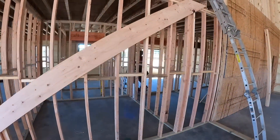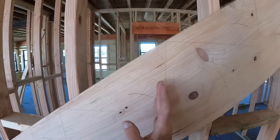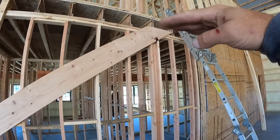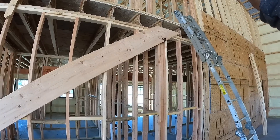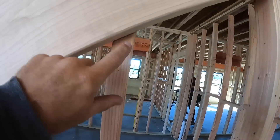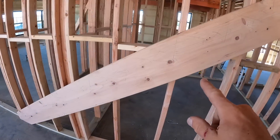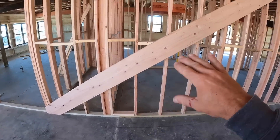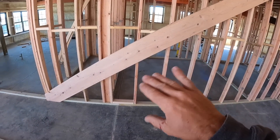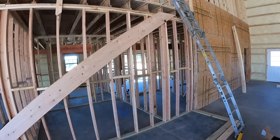We've got this temporarily fastened up there with a screw just to test fit it — making sure we're plumb here, level here, and that our math is going to work up where our landing is and up to the second story floor. It's where we want it, so I marked under here. I can now take this down; I'm going to have four stair stringers. I'll screw them together and cut them with my big saw, then finish with the sawzall so I can cut them all at once.